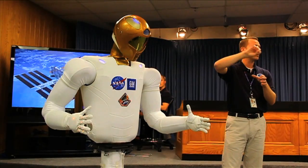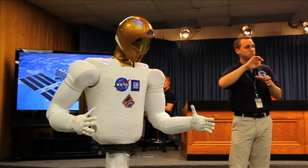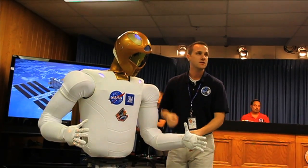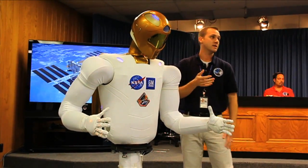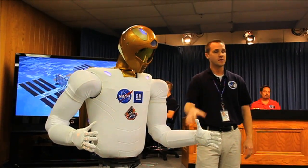Positional robots don't do the round peg and the round hole trick well, because if they're off ever so slightly they build up gigantic contact forces. What this type of technology allows us to do is to feel that peg into the hole. And actually, it's a little counterintuitive, but you actually get the task done a lot quicker, more successfully, and a lot safer.